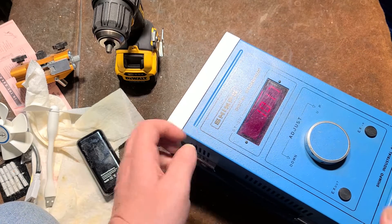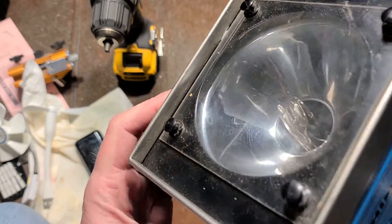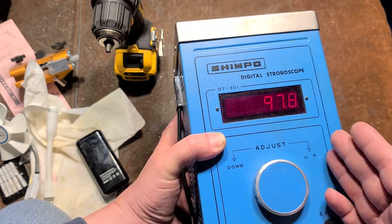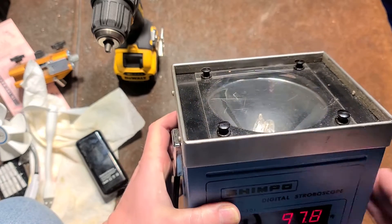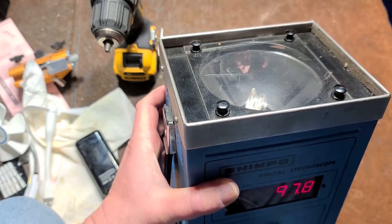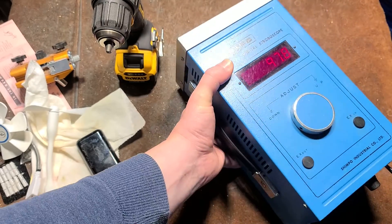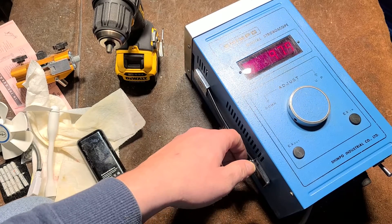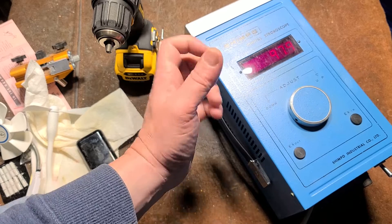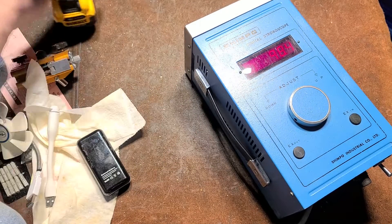This isn't a super bright strobe — old strobe lights need the bulb and strobe capacitor replaced, which really affects brightness — but it's a really high quality unit. It's effectively rated from 100 to 12,500 RPM. The reason it doesn't go higher is that at speeds like 12,000 RPM, the light doesn't dim enough before it's triggered again. Modern LED-based Shimpo units sell new for $800–$1,000 and can read up to 40,000 cycles per minute since LEDs switch extremely fast.